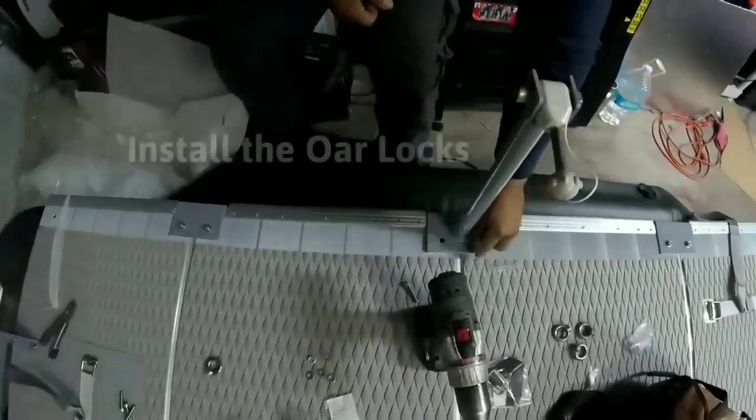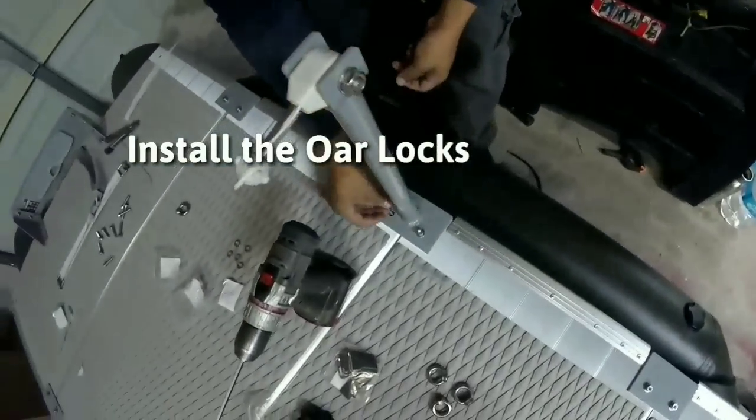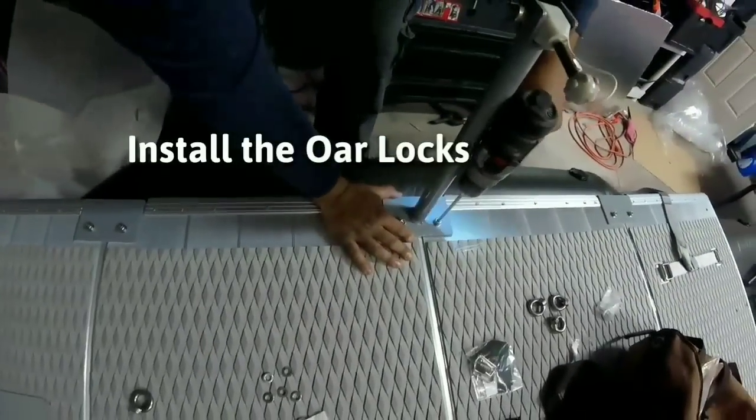The next step in this whole thing is to put the anchoring pins. So that's really important for the subframe pieces. When you slide them through those plastic brackets right there that are welded into the pontoons, on the bottom of those brackets, there's a hole. And these lock pins make sure that those poles don't come out of the area there. So just lock them in place like so. The rings go over the back end. And so that's what really completes the subframe as far as linking it from the back to the front of your boat.